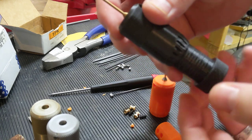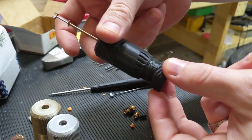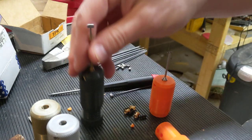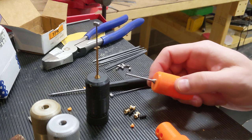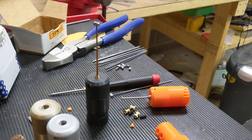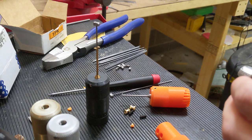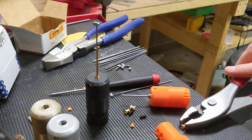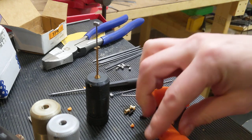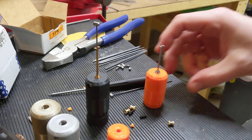You're going to notice if it's really bent out of shape or the handles are really misaligned, but if they're free and smooth and rotate pretty easily, the tips will self-center because they're wrapped around each other. You're mostly just looking for the handle movement to be free and not give you a lot of binding. The DIY kit is pretty easy to build, but you do need a soldering iron — that's about the easiest — or you could heat up the brass with a torch, hold it with pliers, and press it in place. You can get a soldering iron on Amazon for under ten bucks, so pretty cheap. Good luck!